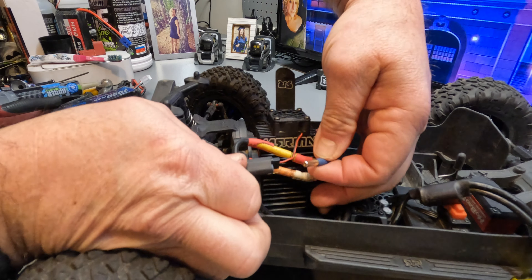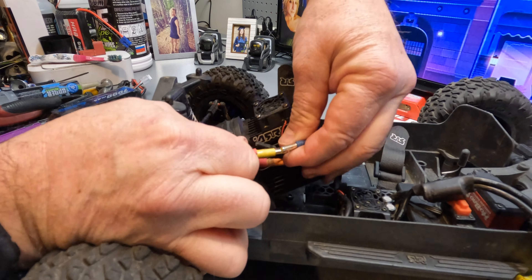We've got the fan and blue wire together, then yellow and orange. I've got some extra stuff on here — it looks like I've got to redo it again. You can see over time the wires chafe, they rub up against each other, and you have to make sure they don't short out. I need to take off this shrink wrap and redo it so we don't destroy this ESC — arcing wires can definitely destroy the ESC.